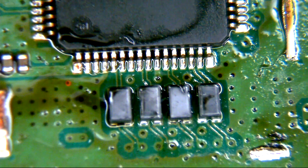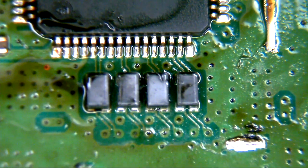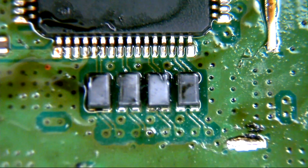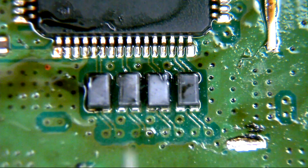So we've replaced those coils now - I would do it on camera but there's not a lot of room under the scope unfortunately. So we've done that off camera. Those are replaced. We're just going to go over those filters again - the two we've replaced. There's a second one in from the left and the one on the far right. We're just going to measure those readings again. If you remember, we were getting cross talk from each side.